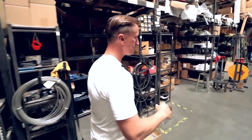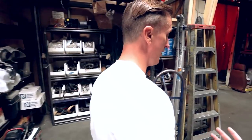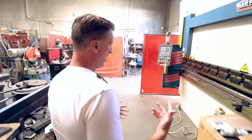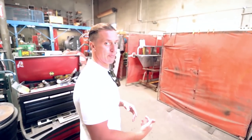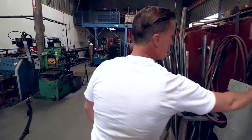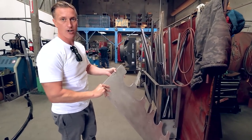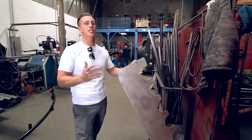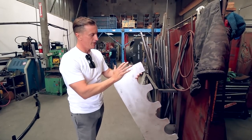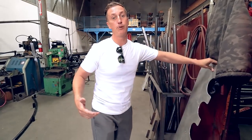So we're going to the fab department now. We use a number of different machines to build our roof racks. For the roof rack feet, we use a CNC plasma cutter — it's a high definition plasma, so you get really nice defined edges. This is actually a roof rack mount; it's a visor that goes onto a Sprinter van. We do a couple of other roof racks out there, but you can see how precise all these cuts are — that's from that high definition plasma.